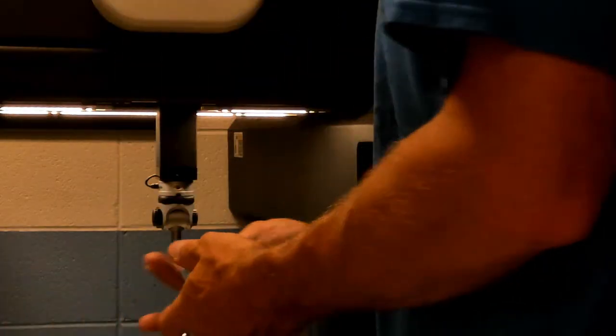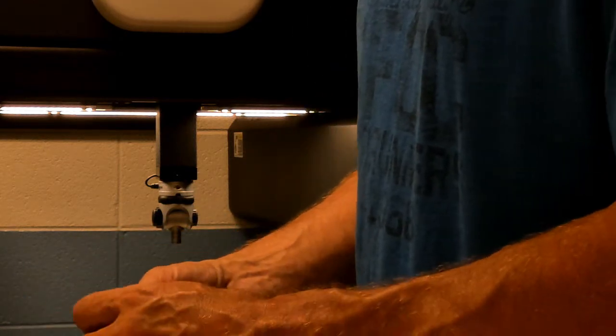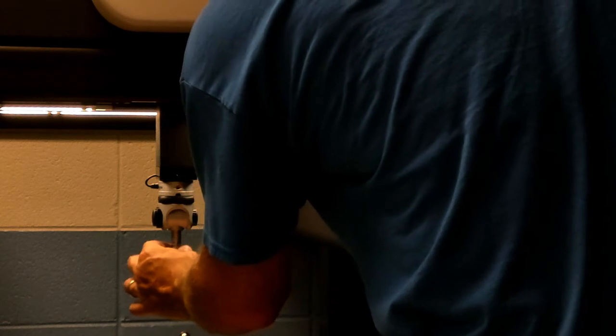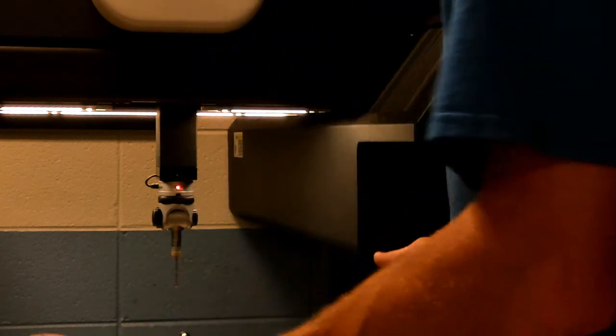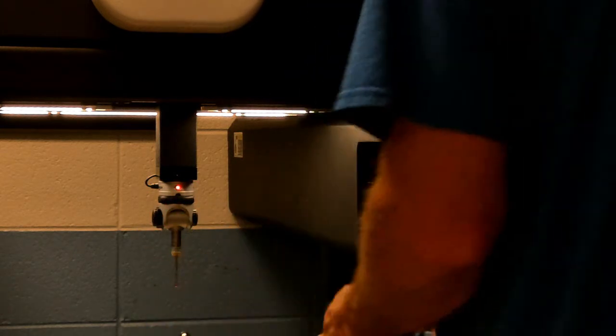What we're going to do today is some cleaning. I've got my spray and rag, and I'm going to wipe down all the surfaces of the machine, starting with the probe and all its pieces. Just regular alcohol is about all you need. You want to find the orientation of the arrows on the head. This is an articulated head so it'll be able to move and shift around as needed.